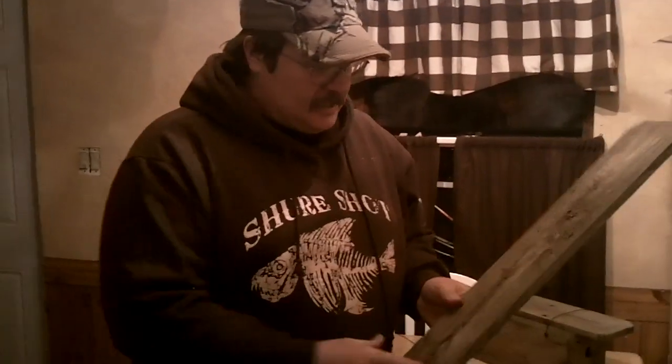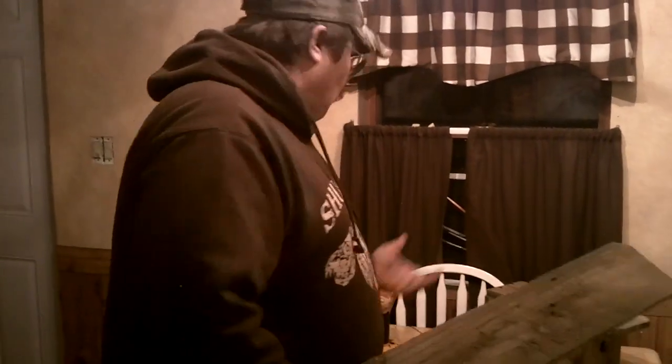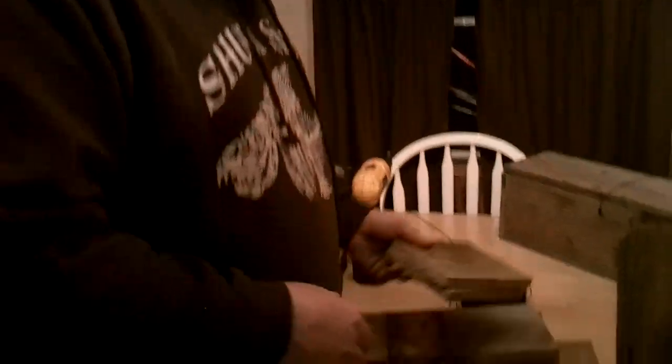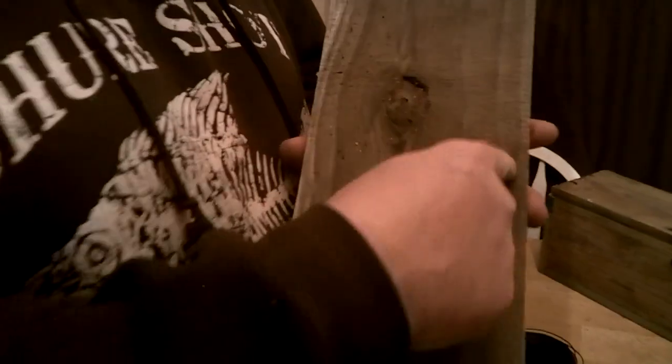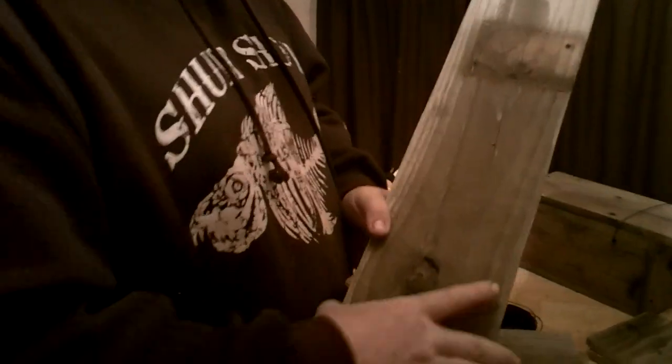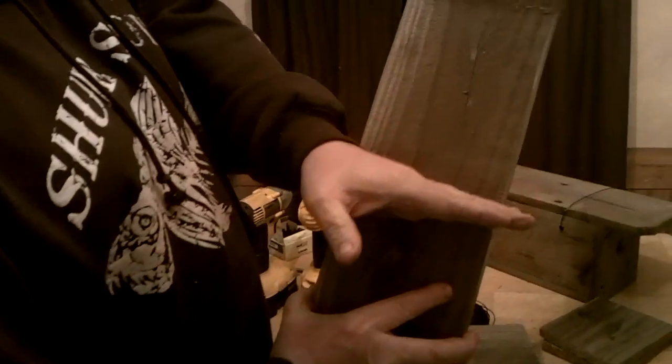You can use a regular one by six, or a one by four would probably work with the rat trap. Basically, what you're going to want to get is two six-and-three-eighths inch boards. If you use decking or something like that, it's probably going to be a little bit longer. You're going to want three 12-inch pieces, and then one 18-inch piece. That leaves you on a six-foot board with six or seven inches left over — good if you get a big knot. The only measurement that really has no leeway is the 18 inches.